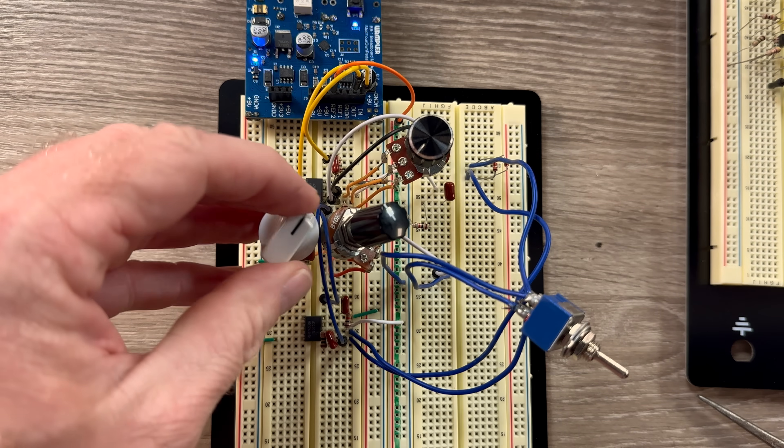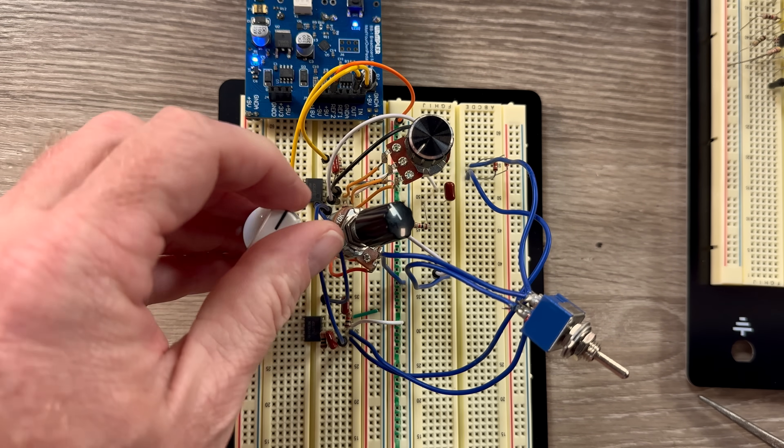One thing you'll notice - I had this volume cranked a lot. So in circuit design, one of the things we have to take into account is when we're clipping the signal really hard, we're going to lose some signal. In this situation, with that type of tone control, I'm probably going to add some other type of volume boosting stage if it was going to be a final product. For this particular video, I'm just kind of showing you the differences of distortion, creating a distortion circuit versus what we've done before with overdrive, which is a little bit different.